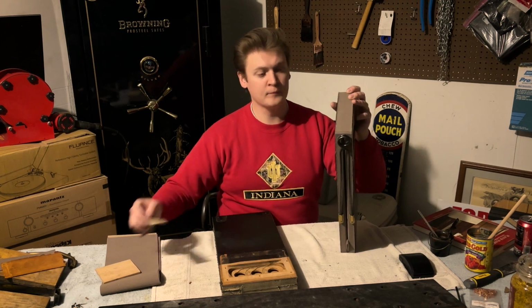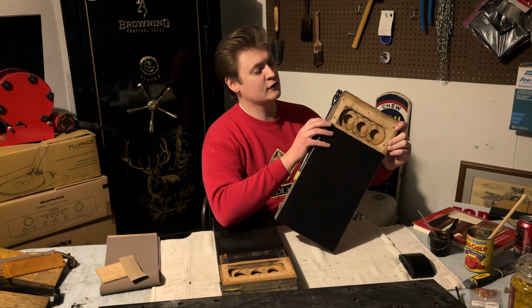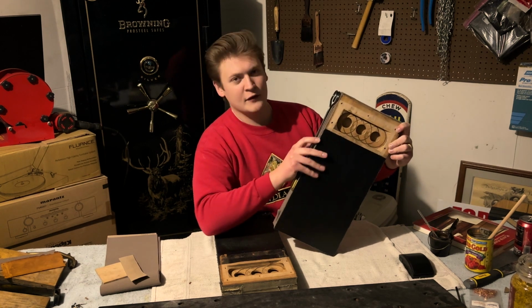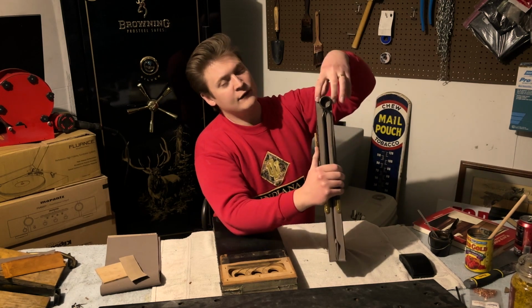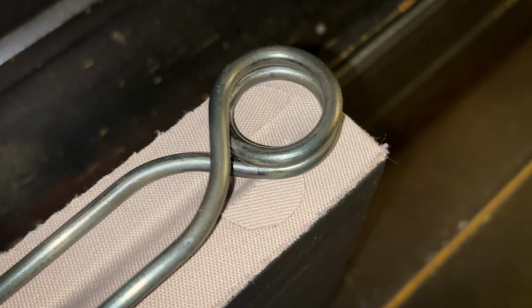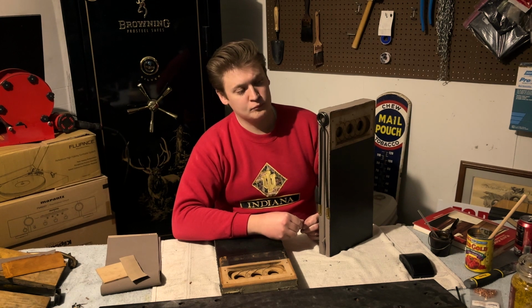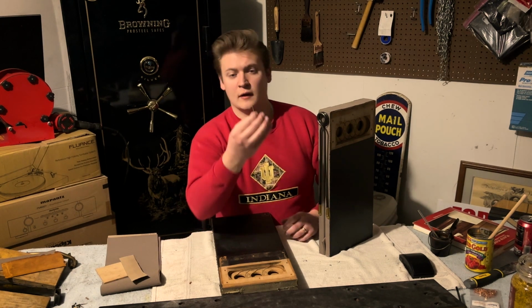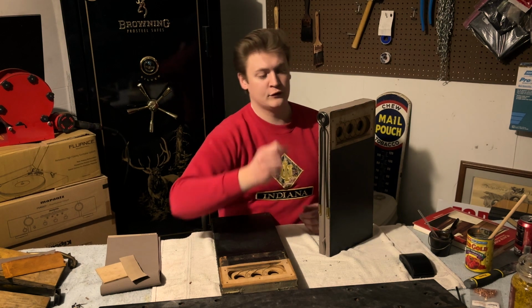Another supplementary piece of cloth that needs to be attached, and again, this is something that I think I'm sitting a little too far away from you to show you very well, but there are two little half-moon pieces of bellows cloth up here at the main coil of the spring. There's one here and one here. I imitated those because they were present in the original. They look just like this. I cut them from the same cloth that I put on the bellows.